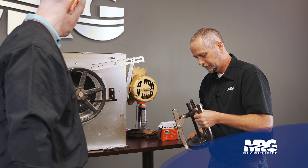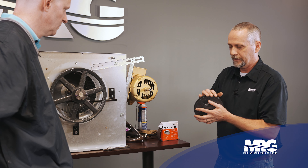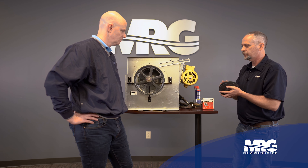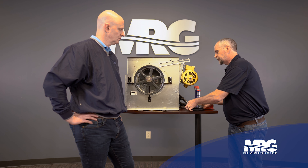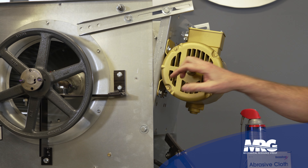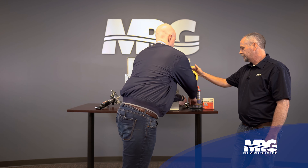You would not be turning this with your fingers — you'd be using a wrench or a drill with a socket on it, maybe a big impact gun to buzz it right off, and it'll slide right off. You've now got your sheave free. The only time you'd probably be doing this on the motor is that the sheave will need replacement before the motor ever will — whether it be a belt adjustment issue or wear. You'll see these sheaves wear quicker than the motor sheaves typically do, so you replace them more often. Maybe you're replacing the sheave or changing the whole motor out — either way, you have to take this off. Make sure this shaft is nice, clean, and smooth with no defects.